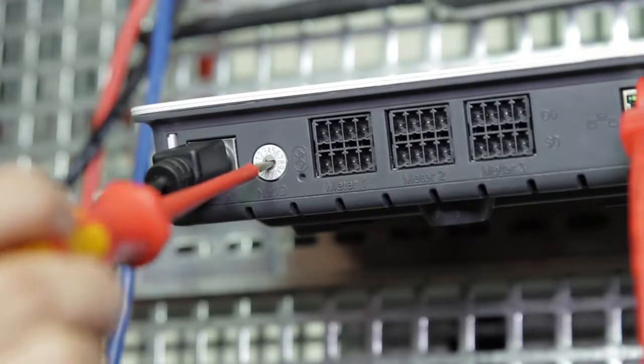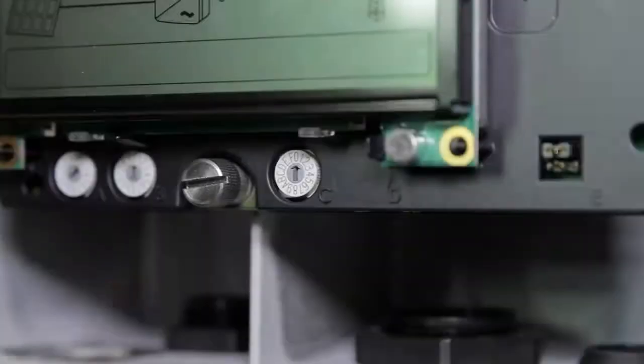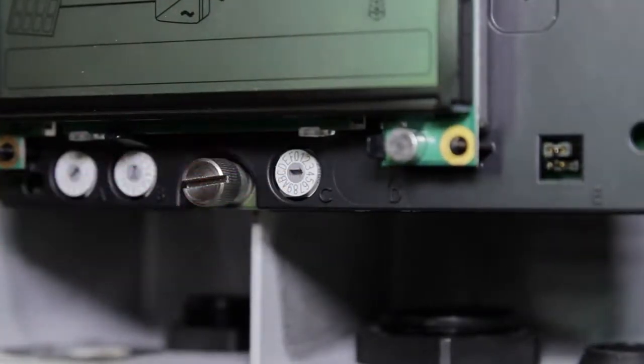If you use Bluetooth connection, make sure you change the net ID of both Sunny Home Manager and the inverter to a number that is not 0 or 1. In our example, we change it to net ID 4. After everything is connected, we can register the system on Sunny Portal.